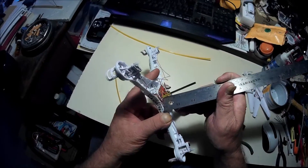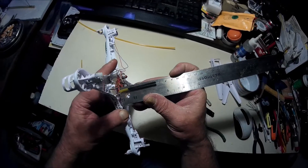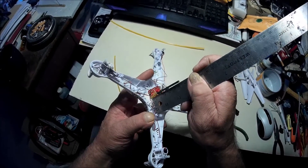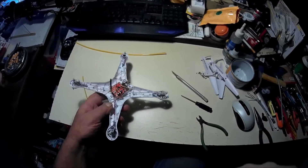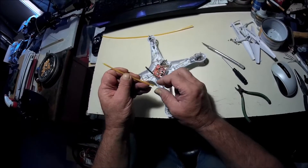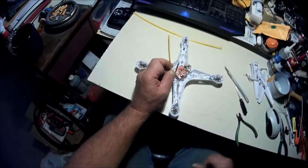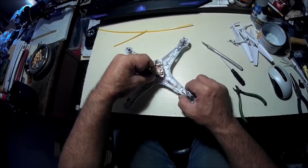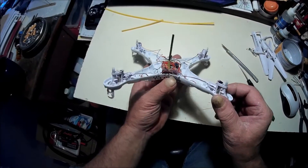I usually go straight from the board out to the end and it should be 62 and a half millimeters long to the tip - that would be a tuned antenna. 62.5 millimeters. You just trim that off after you've got it all soldered together and got your plastic coating - this nylon rod stuff - over it. Get your length and just cut it to that 62.5 millimeters and that tunes your antenna for 2.4 gigahertz, making it a half-wave antenna.